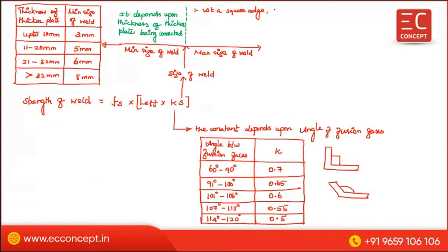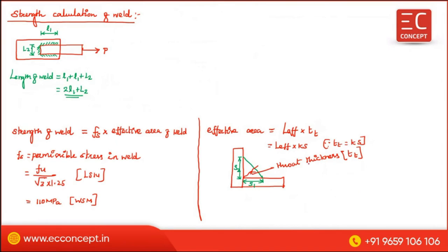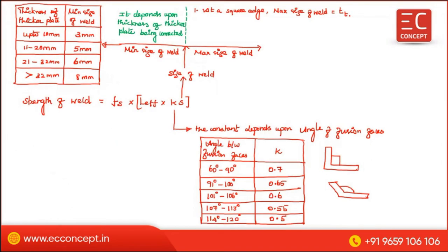At a square edge, the maximum size of weld is equal to throat thickness. TT means what? Throat thickness. Sorry, not throat thickness, thickness of plate. The maximum size of weld is the thickness of plate minus 1.5